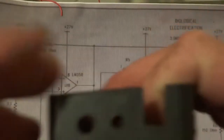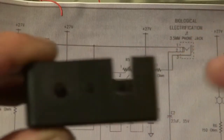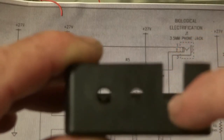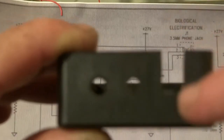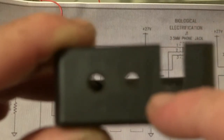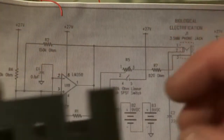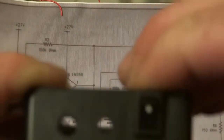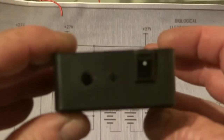You'll also need to cut out a groove. What I've done is basically get a hacksaw, hacksaw a line down this side, hacksaw a line down the other side. The actual width of the hacksaw blade plus one millimetre is roughly the depth that I've gone. Then I get a Stanley knife, cut a line across the bottom, and push it out — it snaps off. Then get a file, file the side, file the side, until basically I can fit one of these switches into the actual socket.